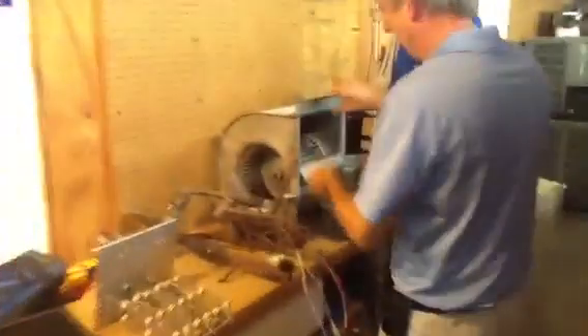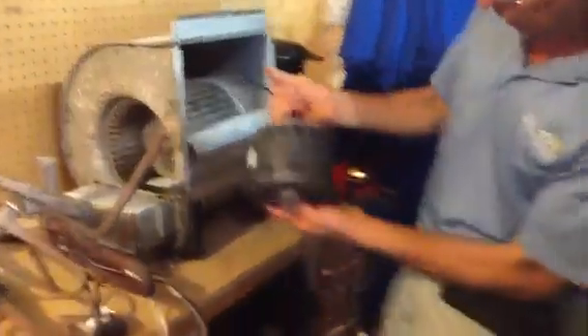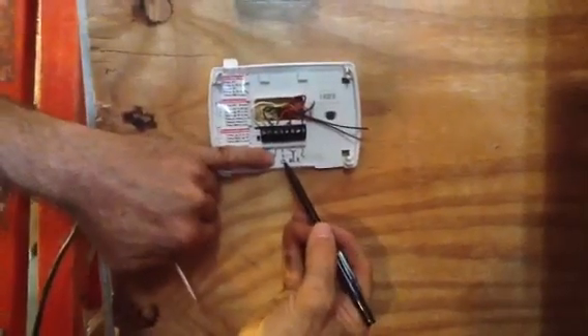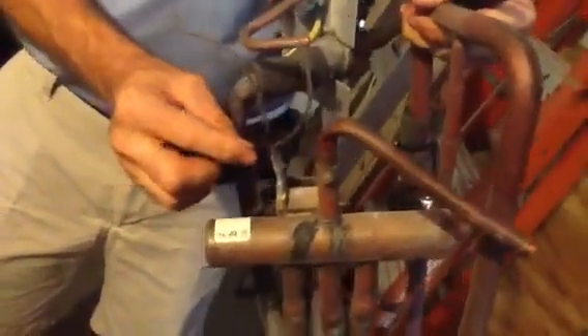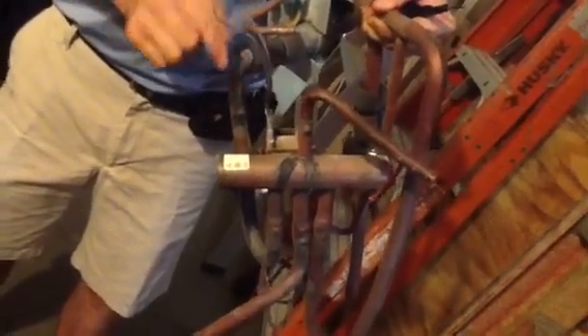Here's your indoor blower — that's the part in the air handler, the indoor unit. It could be in the attic, a hallway, a garage. This here is O — reversing valve — a very important component in the heat pump world. Here's what a reversing valve looks like. These two wires are actually the solenoid that energizes or de-energizes the reversing valve. In most industry standard settings, the reversing valve is energized on cooling and de-energized on heat.